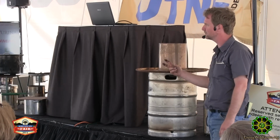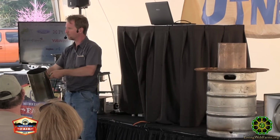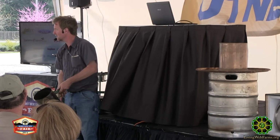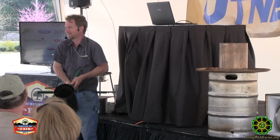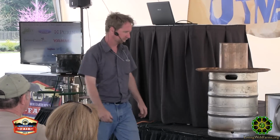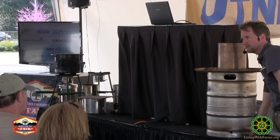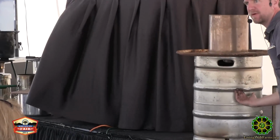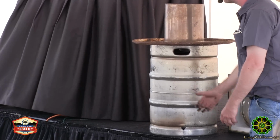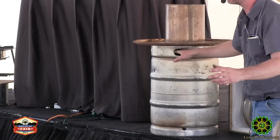The second thing the second cylinder is doing is that in this unit, the secondary air is coming up all around the first cylinder and getting preheated. So by the time it hits your wood gas, it's already pretty dang hot, and that's just making the whole process a little bit more efficient. You could pretty easily just take a 55-gallon barrel, cut it to about this height, and set it up on some bricks so that plenty of air can get up under it to get the same effect. Where 1, it's a little bit safer from touching, and 2, you're preheating your secondary air before it goes up through the handle into the combustion chamber, let's call it.